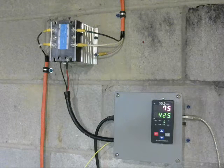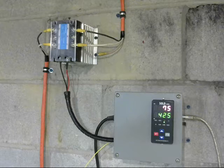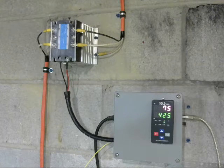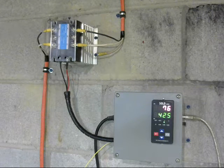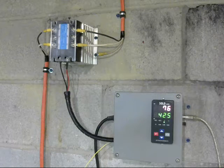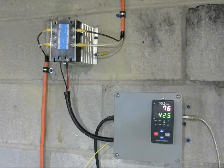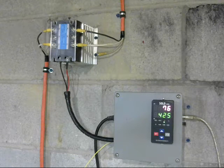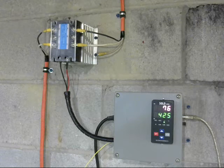Also in this box, besides a bunch of wires, is a USB module. This connects to the back of the controller with a couple of wires, and then you can plug in your USB cable. You'll need software drivers for this, so I recommend you buy a USB module where the computer circuitry is made by a company called FTDI.